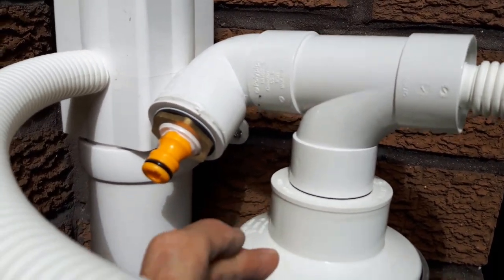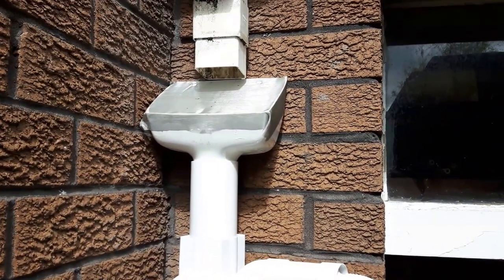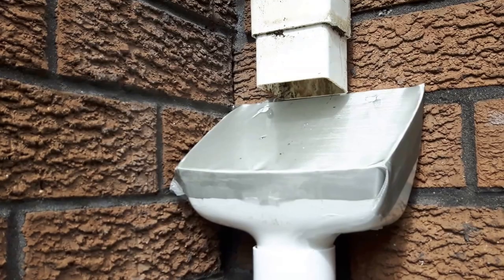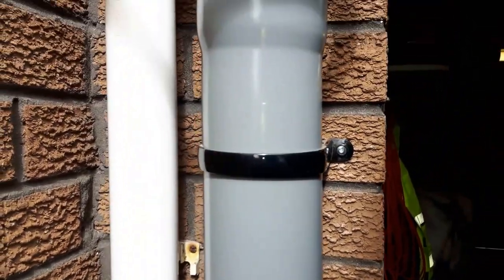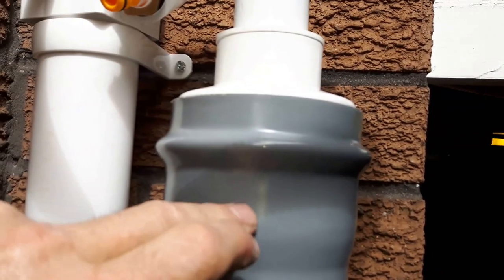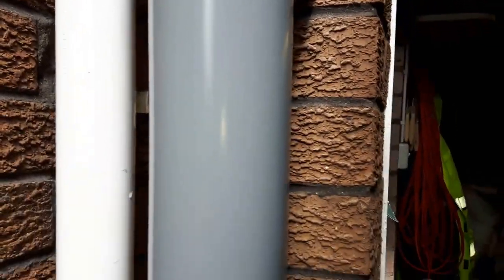Inside there I've got a ball cock. When it first starts raining, all the mucky water off the roof with all the bits and debris and bird poo and all the rest of it comes down that pipe. The big bits get filtered straight off at the mesh. The mucky water goes straight down that pipe into the soil pipe, fills up, and the float makes its way to the top. When the float is up, it blocks this part off, so all the mucky water stays in here and the clean water - after all the rubbish has been flushed off the roof - comes out here and goes to the pond down the bottom.